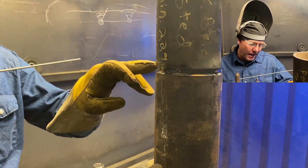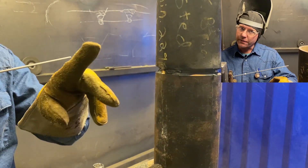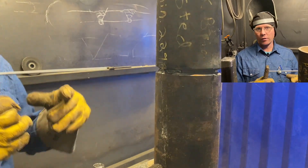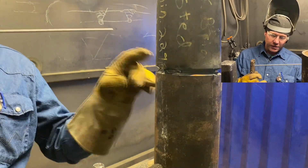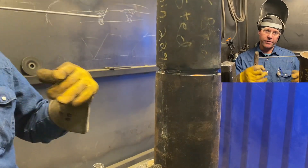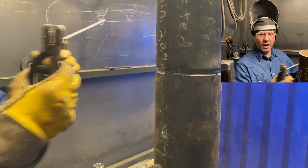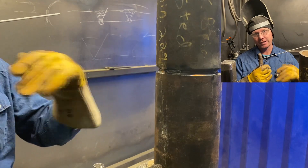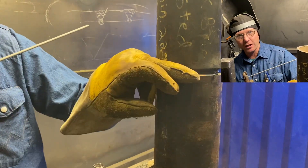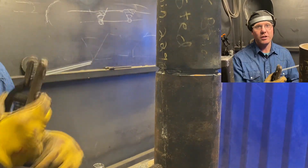I'm going to make the weld opposite of what I just did — that's called quartering out the pipe. The reason for that is when you're making a fit, let's say you're putting a 90 on a piece of pipe, or a T, or some sort of fitting, flanges — you put your three tacks in, you run one quarter, you check your dimensions, and you run the top quarter to make sure everything stays nice and square. You don't want to run the bottom or one side and pull everything over. You want everything to stay nice, square, plumb, and level. So that's why you quarter the pipe. I run this quarter, now I'm going to run the opposite quarter. You don't have to do it on straight joints most of the time, but it's always a good habit to get into.